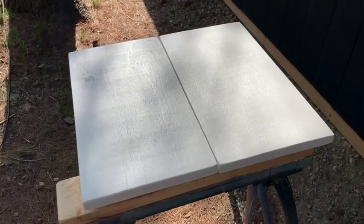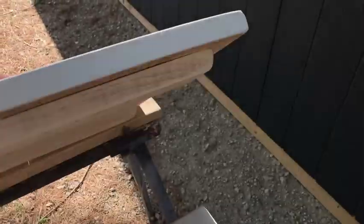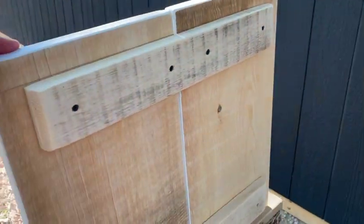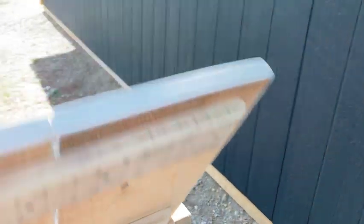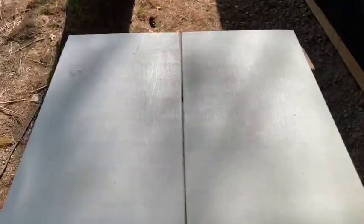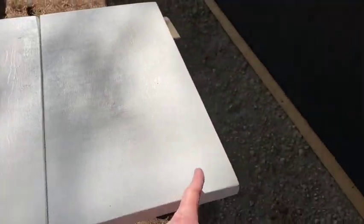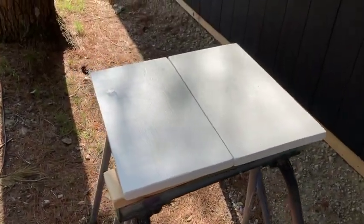Here is how simple the construction is — I have two boards joined together on the back side with drywall screws and some cross members. Everything's sanded down smooth. I'm going to leave the backs of them raw pine, unpainted. All my doors have to be slightly different sizes, so I'll go from the center out and cut just a little bit off each side, put a fresh coat of paint on, get some hardware, and hang them up — and Mrs. Z will be so happy.